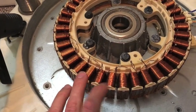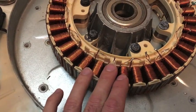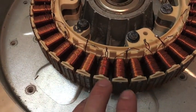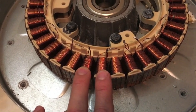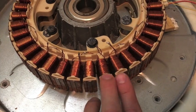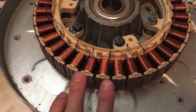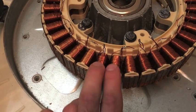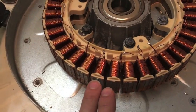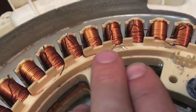What I'm trying to do now is get more torque out of this. What I've done is wound two coils together and skipped one, then two together again. That still gives me 12 faces but I'm doubling the magnetic induction by adding two coils instead of just one coil.